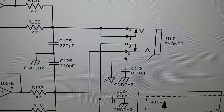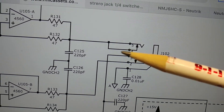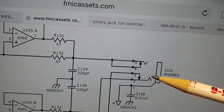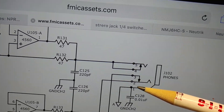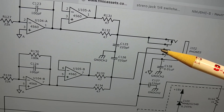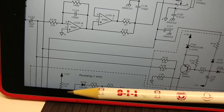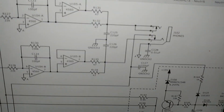Right here is the headphone jack, and you can see there are five pins on this that are in use — one, two, three, four, and five. You'll notice that four and five are wired together, so you can consider that as just one; you can use one or the other. Here is the switch aspect I'm talking about. When you put in your headphone jack, it hits this contact here and bends it and opens it up. So your signal that comes from your guitar comes to your headphone jacks and doesn't go from two to three. But when you pull your headphone jack out, that should make contact, and the signal should pass from two to three, then down to the preamp, out to the power amp, and then to your speaker.